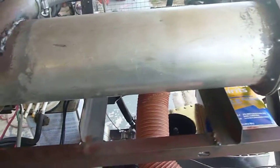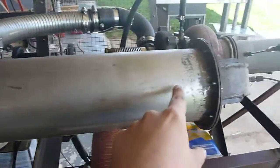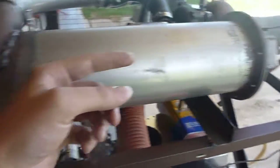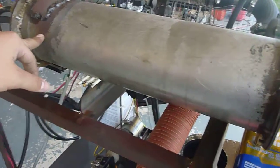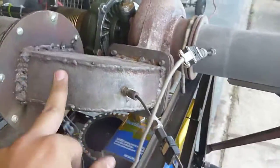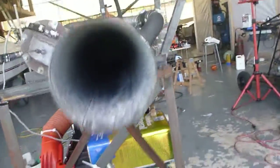We're having a fuel supply problem because with only 10 psi entering the chamber we can only get so much atomization and it doesn't burn correctly. What we're going to do is take some copper tubing, run it down the length of the combustion chamber and back, then have it point inward so the fuel heats up, turns into fuel vapor, and comes out the end as vapor. When we tried a larger agricultural sprayer, the fuel shot down the inside of the tube and didn't burn - only a little bit did.